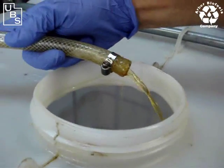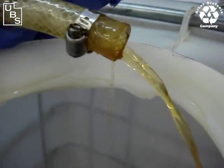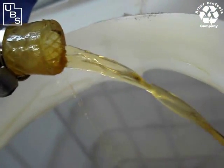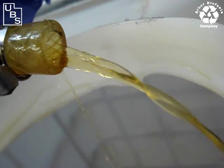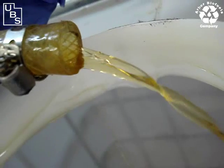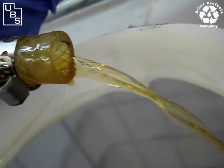You can see it's almost not even a syrup color now — it's almost back to a honey color. We're pumping at about six gallons per hour right now through this ion exchange resin bag. We'll show you what it looks like on the fourth bed volume.